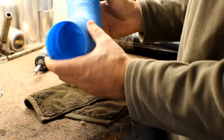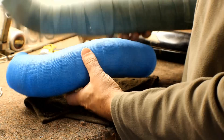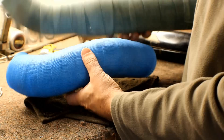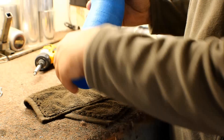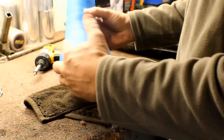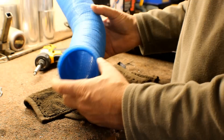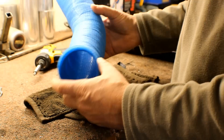Composite — it's basically fiberglass tubing is what it is right now. There are little pin holes all through this just because of the nature of the casting material. At this point you can sand it — you can see I've kind of sanded this one a little bit. It sands just like fiberglass. And then you can either fill it with traditional fiberglass resin to seal up the pin holes and you're ready to go — put some couplings on each end and you've got some tubing. Or you can reinforce this with a sock-type carbon fiber weave, which I'm going to actually show you how to do in another video. So stay tuned.